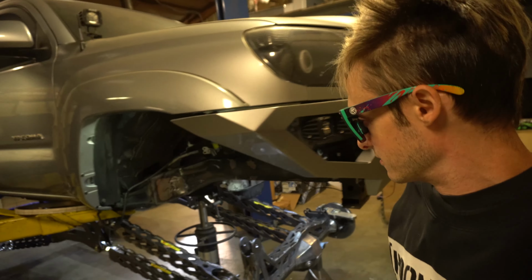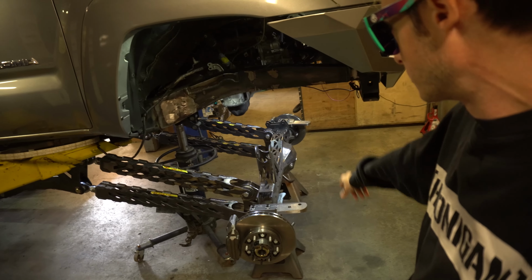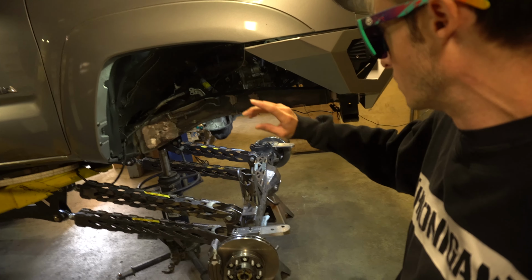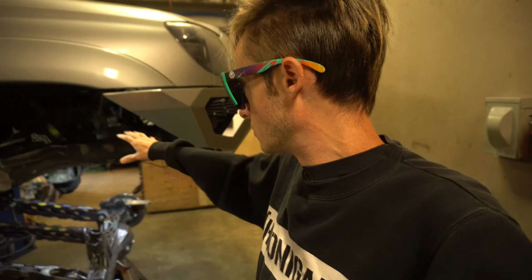And another episode, let me get under this trickle charger, working on Gigantor. Today, we're gonna finish welding on the front. We gotta weld the four link mounts onto the axle, fully weld the coilover mounts on, and then move on to welding together the front cross member and tacking the coilover towers on, sorry.